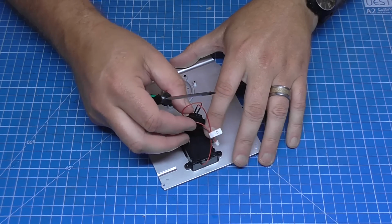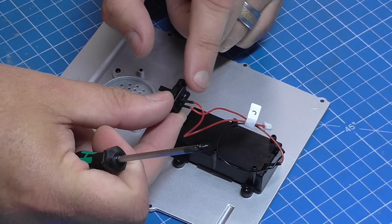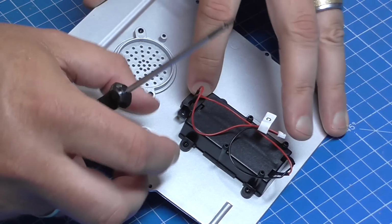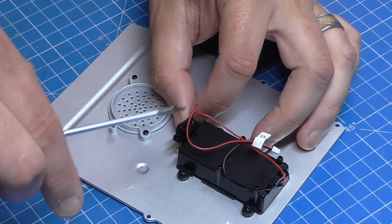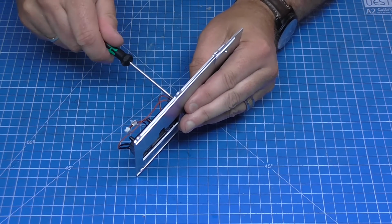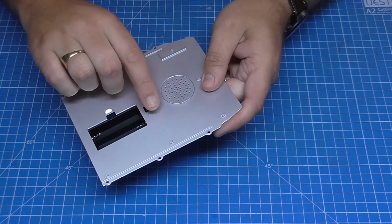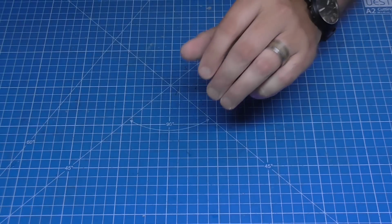And then with this switch, we want the 2 wires here to be facing towards our right, so the one that's got a vacant contact will be on our left. So this is going to go in this way. And again, once I've got this in, it's a BP screw, which is going to keep these in place. And just one here. And then we check that switch operates. No problems at all. And that is all there is to do in that stage.